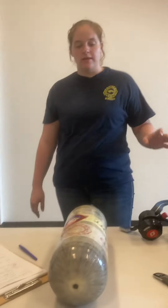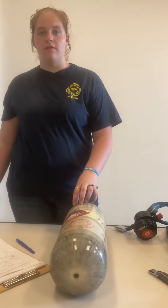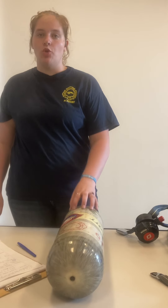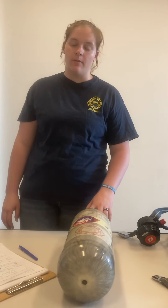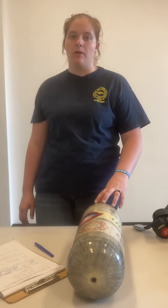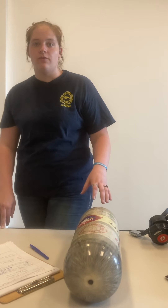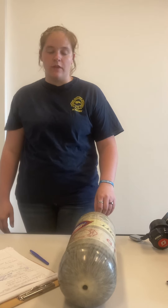Starting with the bottle or air cylinder — there are three different types: steel, aluminum wrapped fiberglass, and kevlar or carbon fiber composite. There are also three different sizes: a 60-minute bottle, which is the largest, a 45-minute bottle, and a 30-minute bottle. The size also corresponds with how much PSI is in each bottle.